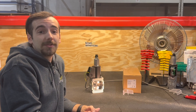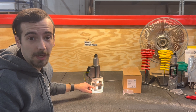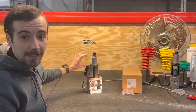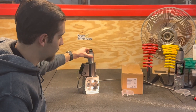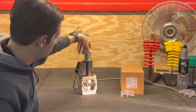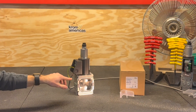Next, we will be adjusting start rate — that is how fast this will come off the seat of the valve. This here is the dampening unit. There are three set screws around here that you will need to loosen, and this is able to be rotated a total of five turns. I will show you how it will be set from the factory.